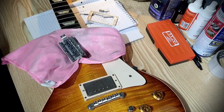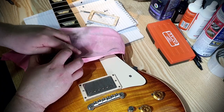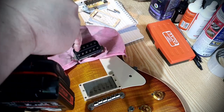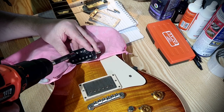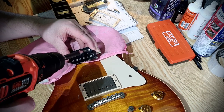This is the only hard part of the job. It's a difficult thing to do, but with a flathead screwdriver and some patience, you'll get it done. Next, we're going to slacken off the pole pieces. We don't want to take the screws out completely, but we want them to be clear of the base plate below, just so we can lift the bobbins to flip the magnet.